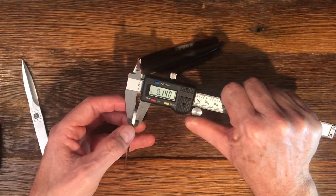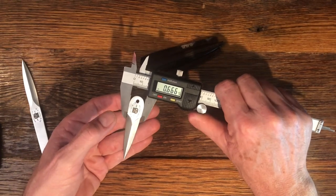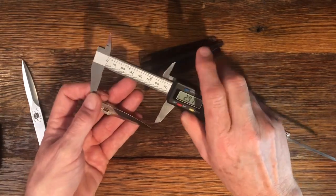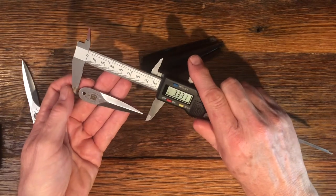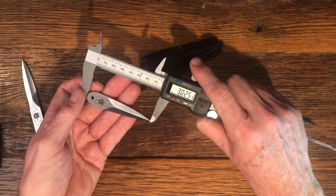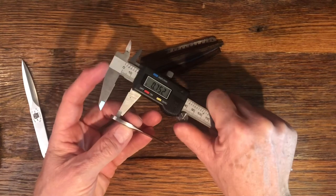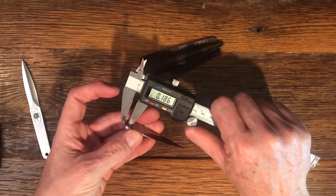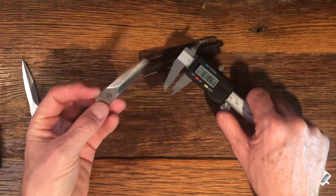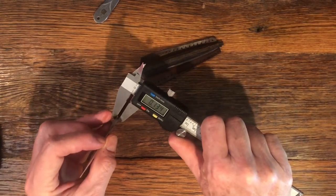The thickness is 0.14 inches. Width at the handle is 0.66 inches. The hole for the lanyard, just in case you want that, is 0.184 inches from the rear of the dagger itself. The large one is going to be the same thickness.